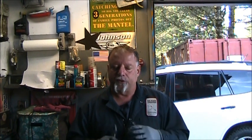So we're going to take it out, and first I'll have to just take it easy, do some idling out of the channel at low RPMs, then I'll bring it up to about half speed, run it like that a little bit, shut it down, restart it, run it in reverse, and just make sure everything's working right. And after I've run it a while, then I'll do some short bursts of wide open throttle on it.